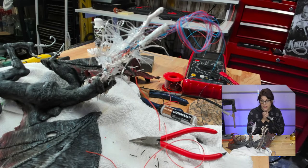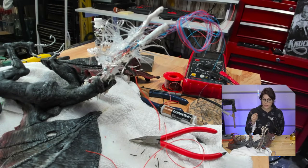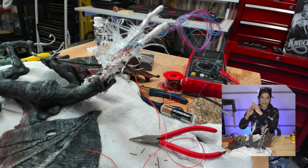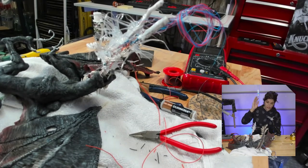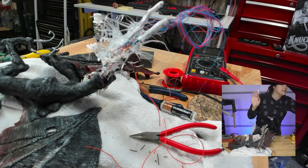And Bounty Hunter Dave Beck was asking, was this LED one the one we glued, or another gremlin? No, totally different gremlin. So it was a full-on LED. The gremlin we glued was not letting anything light up. It was just a short in the whole system. It was where a wire was going on top of a resistor, which is fine. That's insulated enough for my purposes.